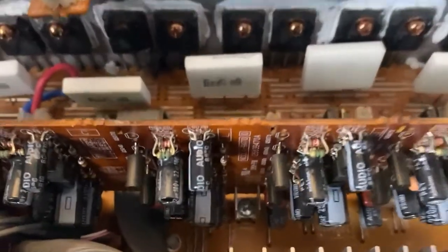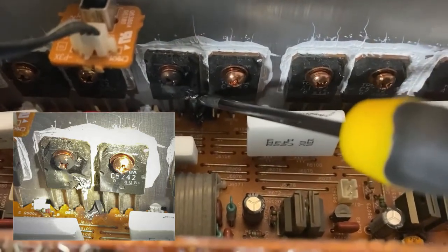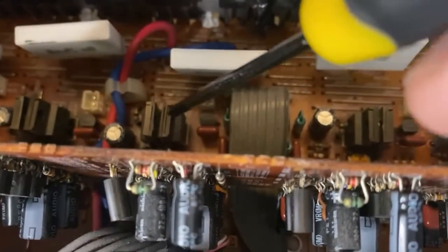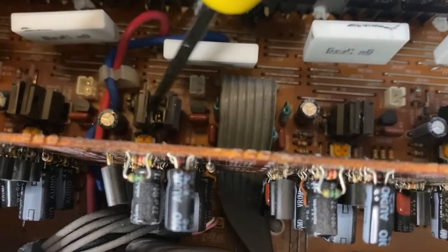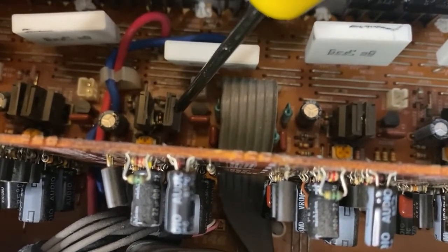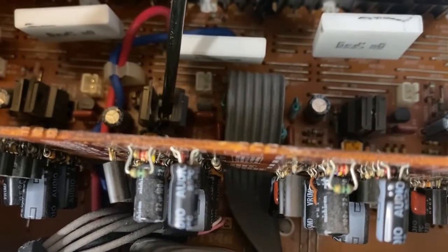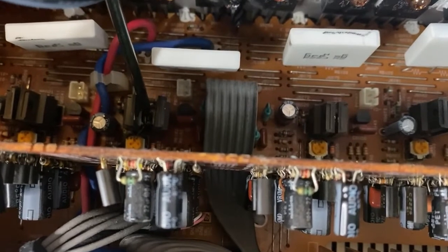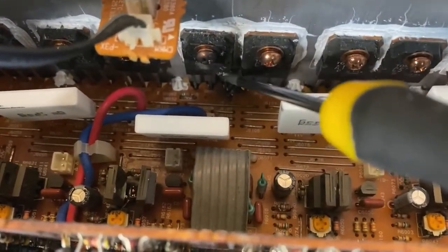Let's see if I can zoom in so you can see. This is the one that has gone wrong — it didn't look like that before, I promise. What I think happened is while I was looking for the best angles to get the probes in, I separated these two transistors. There is a transistor in the middle which monitors the temperature of the two output transistors. I opened them up to see the part numbers, and it looks like that middle transistor has actually broken — so when I powered it on, that caused it to go poof and release the magic smoke.